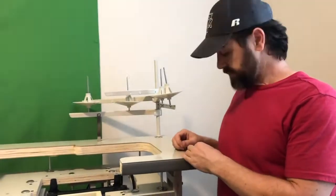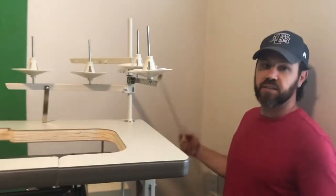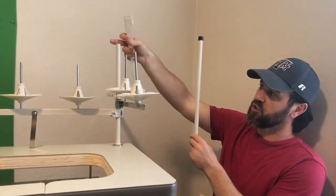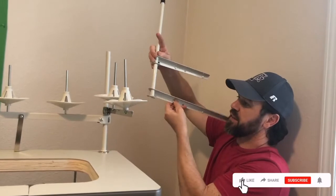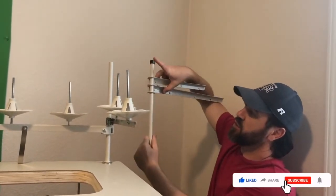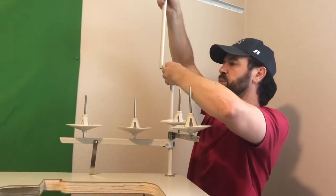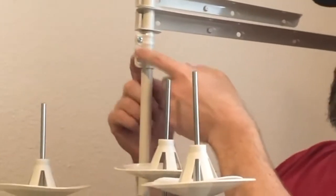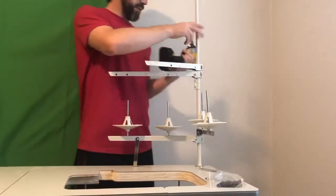At this point we're just going to take all the plastic off before putting the motor on, so we don't cover plastic edges and have an issue later. Now to get the extension bar on, use this bracket — it's already got the bolts and nuts in place. You want to get the two arms that go above the joining portion on first, so just slide them on. They say to keep it at least two inches below the rubber cap. Then put this piece in place, drop it down, and slide the top on. Tighten the two nuts and bolts — 5/16 socket and a 10mm socket — to get these bolts tightened down.